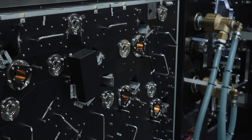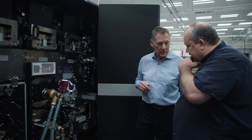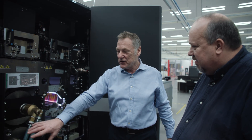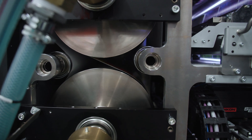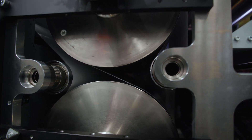After the dryer, the first thing we do is chill the paper. There are two chiller rollers which try to bring the heat back to pretty much where the paper came in, so it's stable again before it gets to the second engine. That's chilling fluid — essentially water.